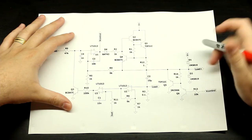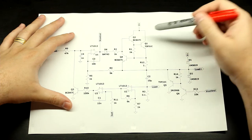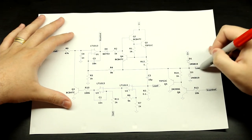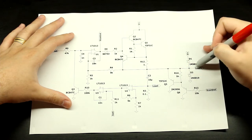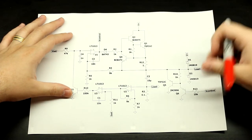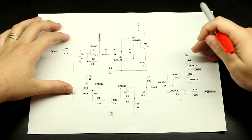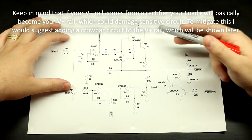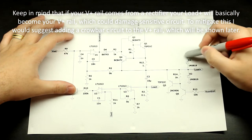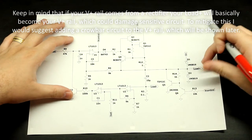This works very simply. Let's say you put a voltage here that's higher than the V-plus on your supply — let's say your V-plus is 20 volts, or maybe just 10 volts because you want a zero to eight volt supply — and you plug in something like a battery that has a higher voltage. This just provides a nice path for current to flow and hopefully mitigates any problem you might have. This is just a dead short to your V-plus rail, so if you put a battery here it's going to short out the battery with that rail, and all that limits that current is the dynamic resistance of this diode. Keep that in mind. This is also here to mitigate capacitive and inductive loads.